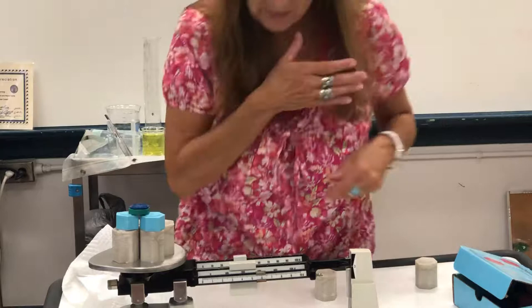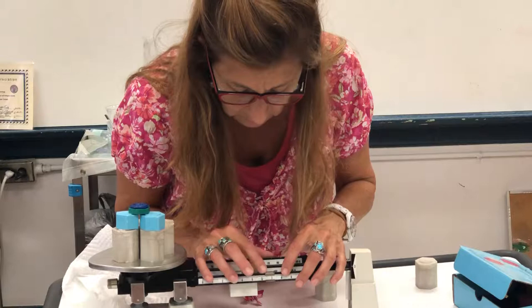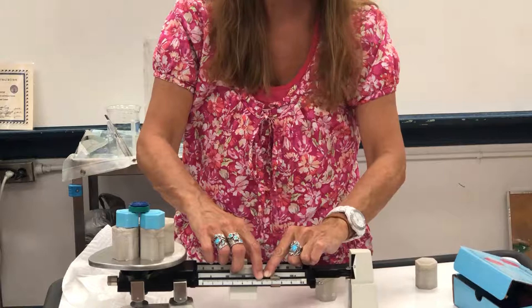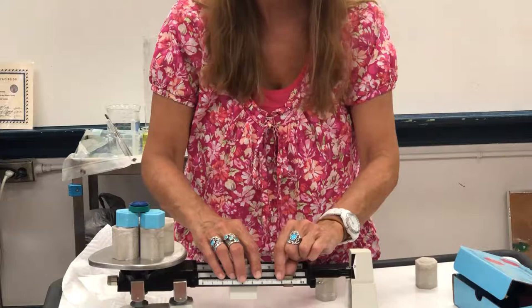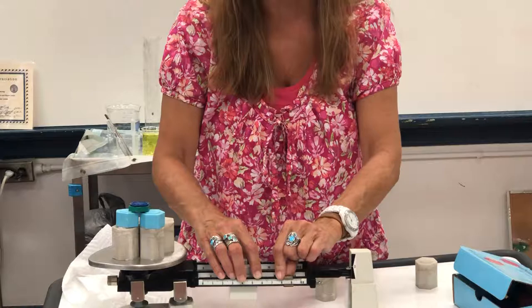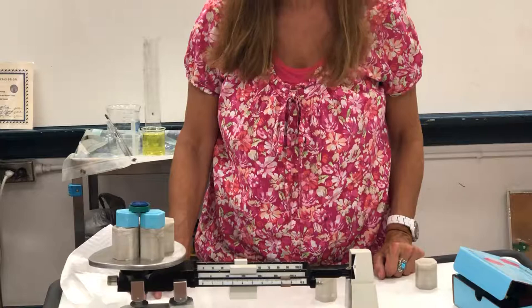So I have it on six. If I was in between six and seven, what do you think each of those small black lines on the bottom beam is actually worth? Think about that. Between six and seven there are 10 lines, so what would be one-tenth of one gram? 0.1 grams, or one-tenth of a gram in a decimal system. So I can even mass things down to one-tenth or one-hundredth of a gram with this particular tool in the laboratory. That's pretty sensitive.